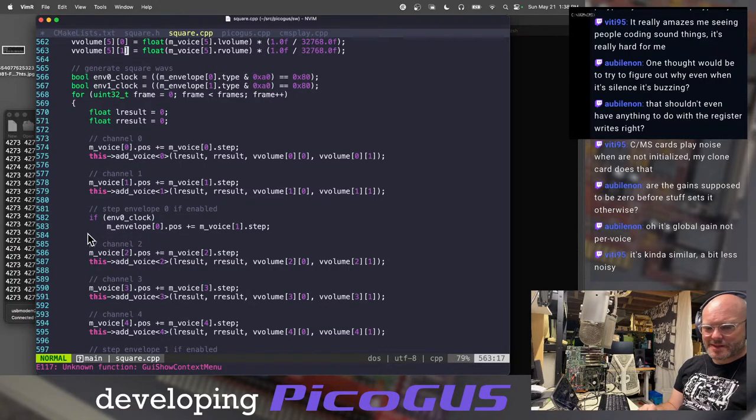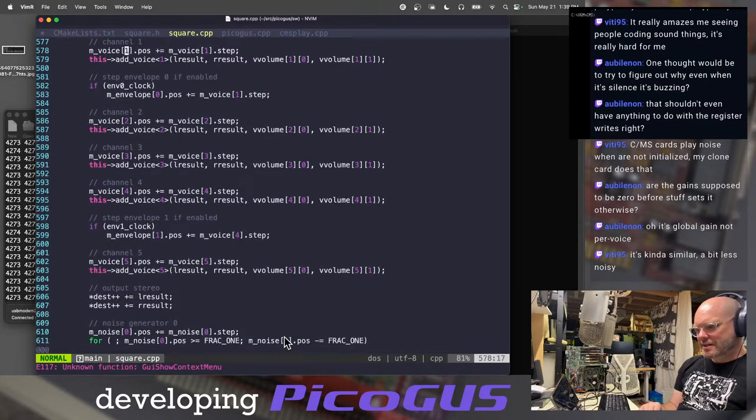Maybe hack a little bit with some stuff with IRQs on the GUS mode to get some games running better. I was kind of playing around with some stuff in some games before. Let's do that. I feel like shifting gears here because I'm not really getting much of anywhere with this right at the moment. And I'll bug Aaron about this to see if he has any insight into this, because after all, he wrote it. And also I'm going to take a stab at converting it all to integer ints instead of floats. I like ints. They're precise.